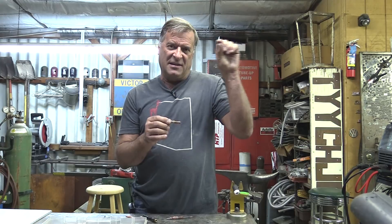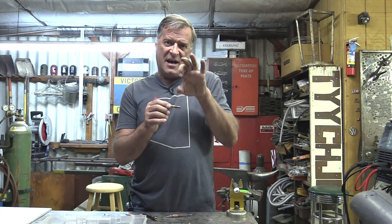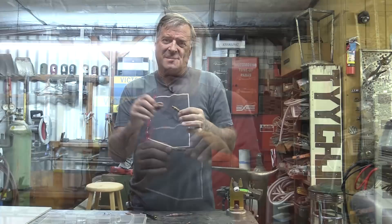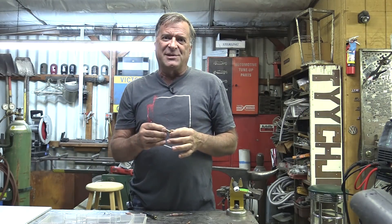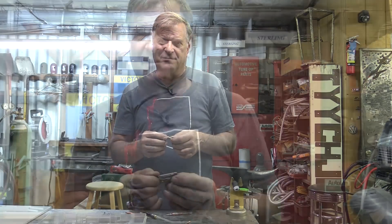What that bulge does is it actually plugs up that little sleeve in between the collet and the collet body — that tiny channel that the gas actually flows through. That collet swelled up because somebody — that would be me — tightened it down too much when it was still hot, and that caused it to warp and misshapen. I wasn't getting consistent gas flow out of it, and that's what was causing all my problems.